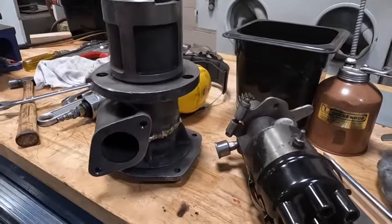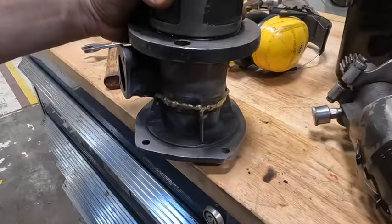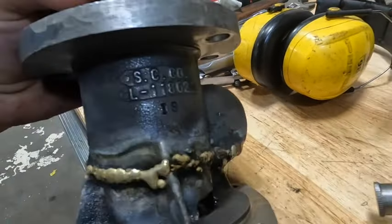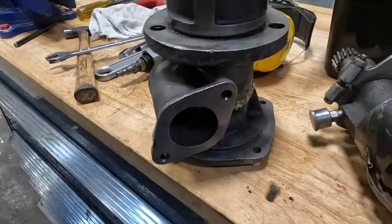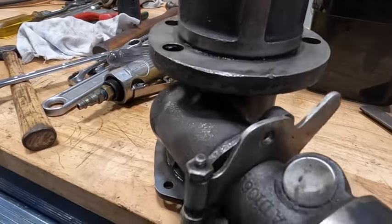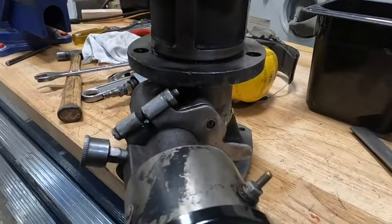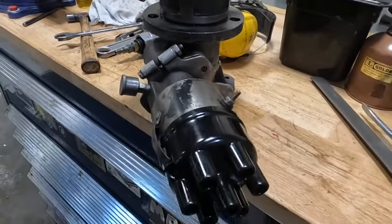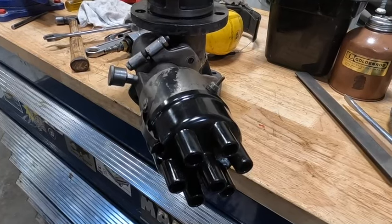Update: I just finished brazing up this casting. Still need some more work — we have to go around and grind off some of this stuff — but it came out really nice. Everything's square and I think we're going to be just fine putting this back together. I'm test fitting the distributor to make sure it fits in here, because we had some of this casting break away. And it looks like it fits just fine — goes right in and lines up. That's really good news. Now we have to see if this whole thing goes together once the parts come in.